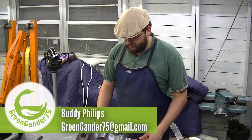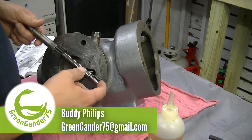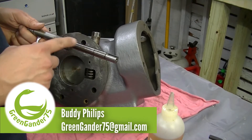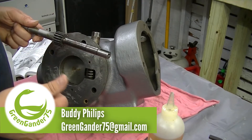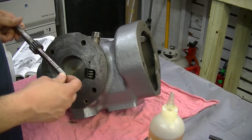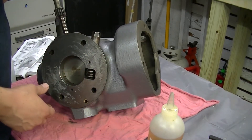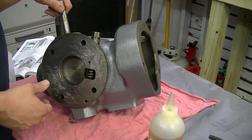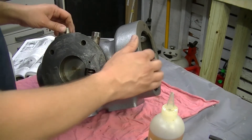Let's get started putting this mill back together. I'm going to go ahead and put in the pinion shaft right here. I've already lubricated the shaft with some machine oil and I put some grease on the pinion shaft gear. I'm going to go ahead and put it into the quill housing here, and this slides into a bronze bushing which is still in place — do not remove it.